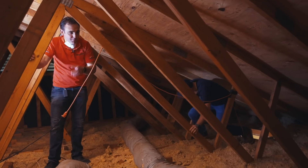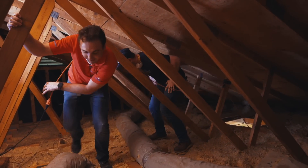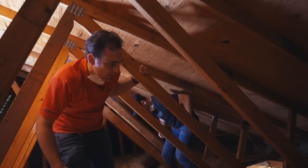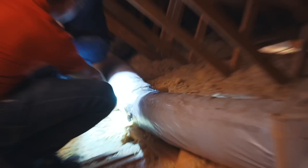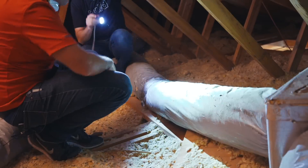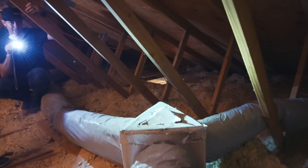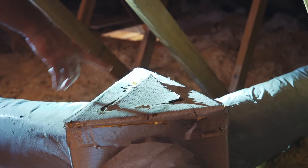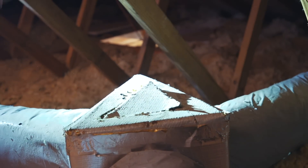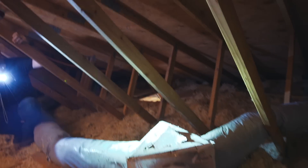These triangle boxes are called cheese wedges, so it's funny that mice like the cheese. There's a cut on one of those cheese boxes — obviously some previous person came in to inspect and didn't seal it back. Duct leakage means you've got cold air coming out of these unsealed seams, which causes all sorts of issues.